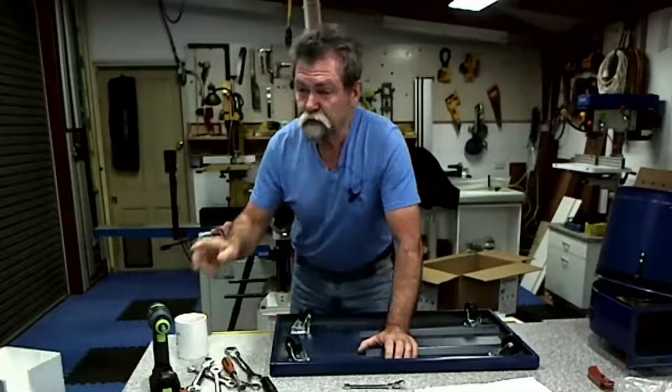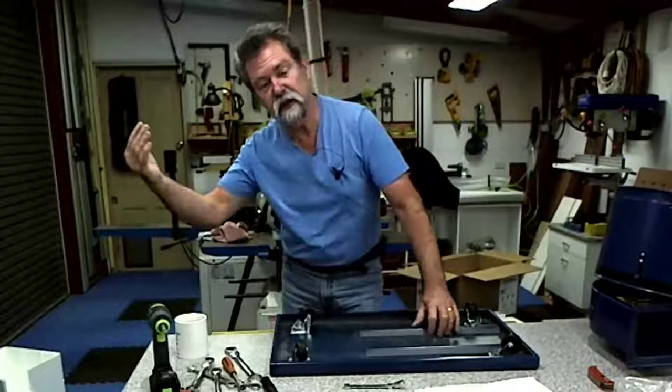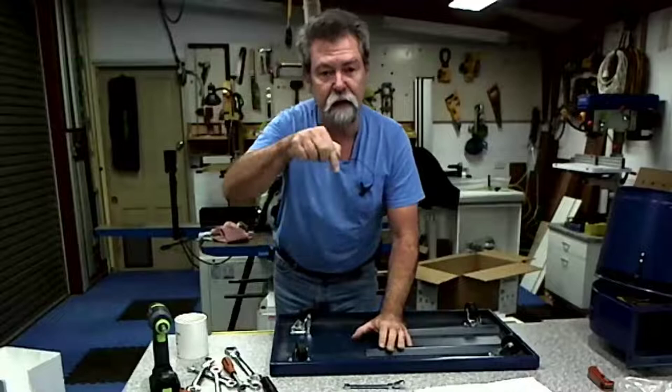So, as I say, with the CNC machine, the X-axis is the router actually traveling left and right across the job. The Y-axis is down the job, so down the sheet or the piece of plywood or whatever I'm going to be cutting with the router, and the Z-axis is up and down, so that's how deep the router is going to be plunging at that point. It's really, really very easy, and I'll go through it all in the video.